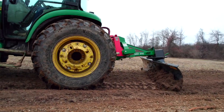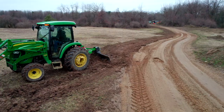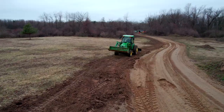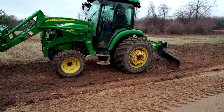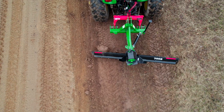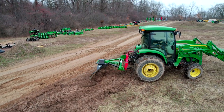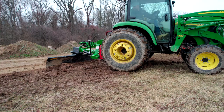And so this was a trial and error experiment for me. I'm putting in a drainage ditch, just a shallow ditch alongside the gravel driveway in a couple of different areas. I've got a lot more areas to do, but this was the first go at it to see how I could do. And I don't want this to be a super steep drop off. If you're driving a quad or a tractor over it, the skid steer makes a big up and down motion. I want it to feel almost natural.